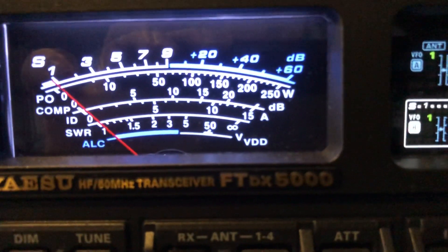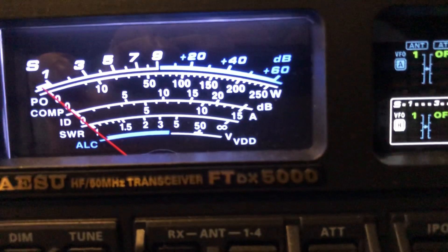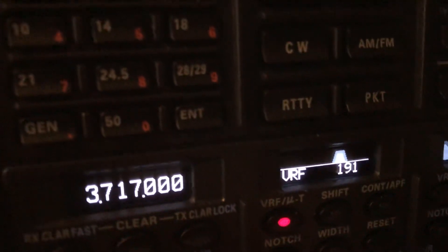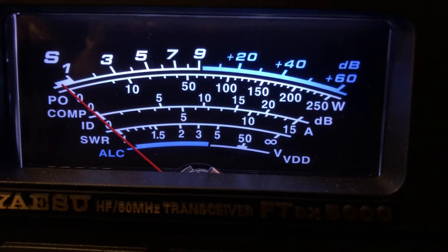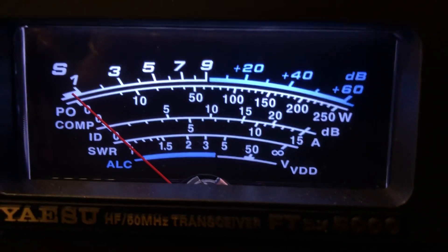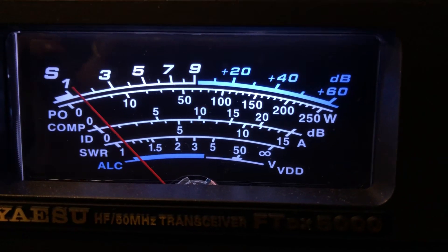Let me pan over to the S-meter and let you look at the noise floor — it's not terrible. Now I'm going to kick the VRF in and see the noise floor drop to zero. There is a little bit of insertion loss, but I'll find a signal in a minute and show you how it's negligible. It's set on 191 right now. There are little relays in there that click in the different LC networks. You'll hear the receiver noise drop as I move up or down from the peak. I'm going to turn the VRF off and you'll see the noise floor comes back, bouncing around on S1 — and now VRF is back on.